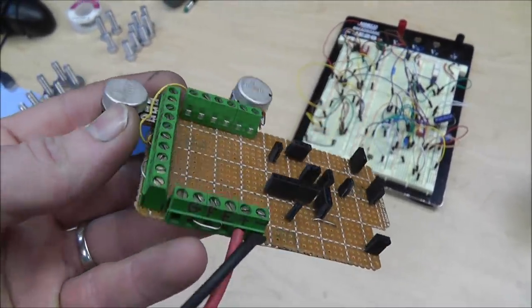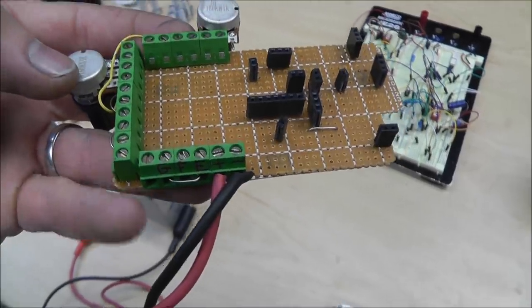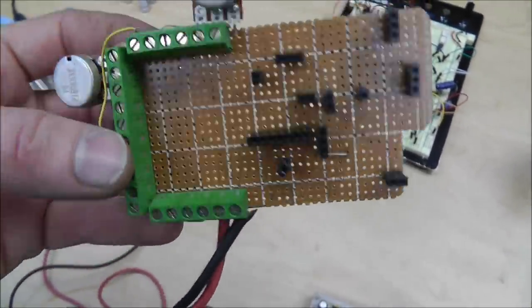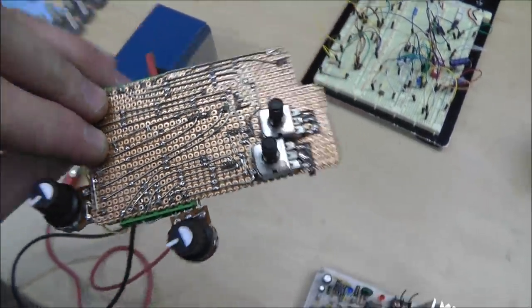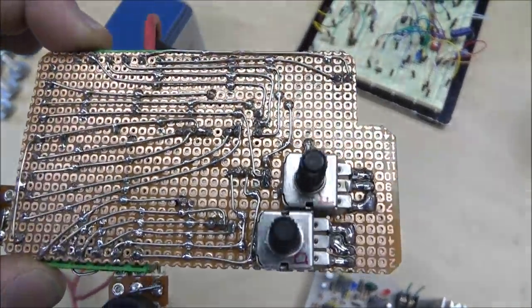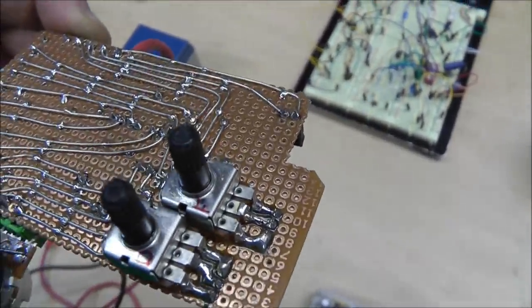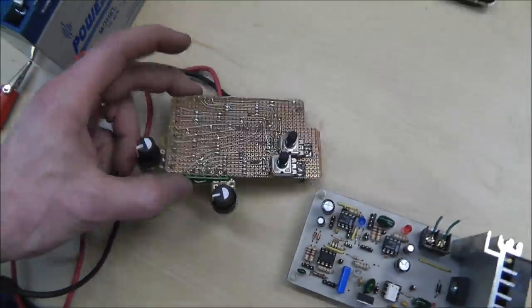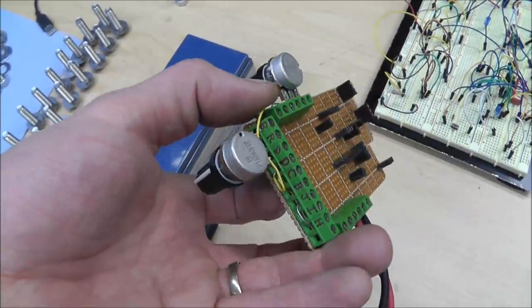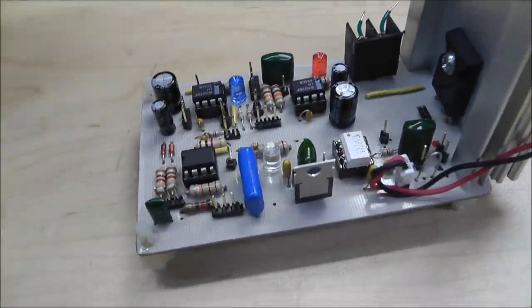I have all my inputs labeled on the schematic. There are switches for different time ranges, automatic pulsing, manual pulsing, and overrides — all sorts of different functionality. The back side looks like total chaos because I didn't feel like etching a second circuit board, so I laid everything out with a standard bus bar arrangement. I also mounted my two potentiometers for frequency and duty cycle right on this board, since I only plan on setting them once and leaving them set internally. The external controls will connect via terminal connectors.